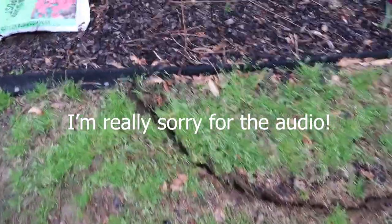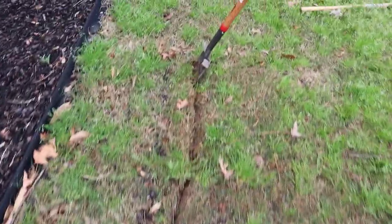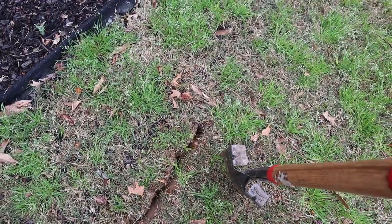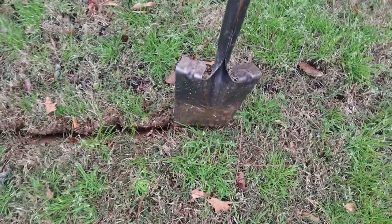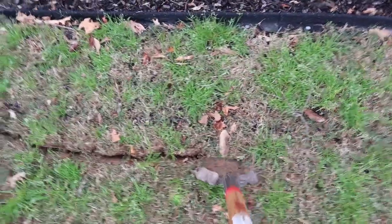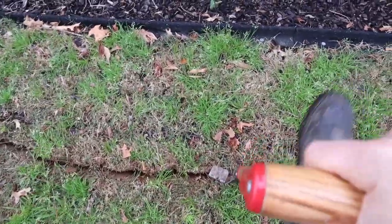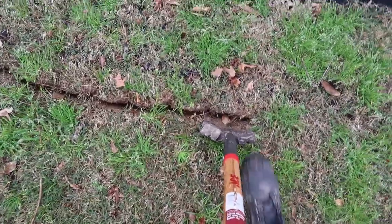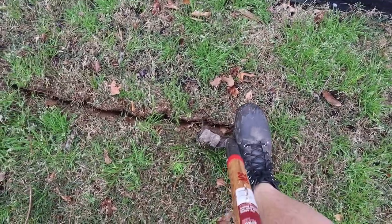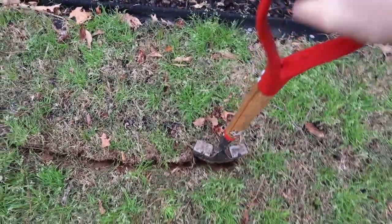So let's say we're starting from this area over here, coming from this light right here, coming out into the grass. I've already started trenching, and I'm going to show you a technique of how to actually shovel so you don't spend the entire day trenching in the grass. So what you're going to do — I like to use my right foot — you're going to press down, stomp down, pull back, and as you're pulling back and then moving forward, you're going to push down again, and then push forward to open up the gap.